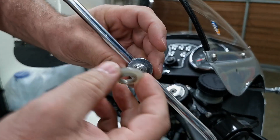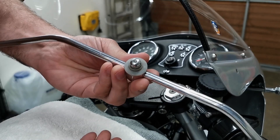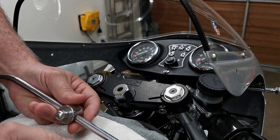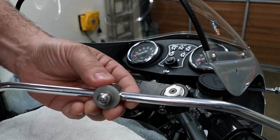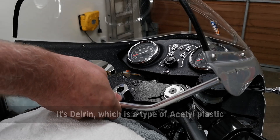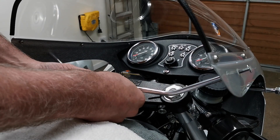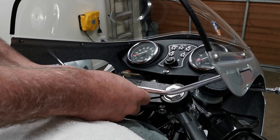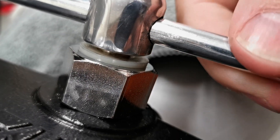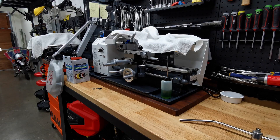One side has to spin - either the inside bit spins or the outside bit spins. I mean this piece either squishes down tightly onto that and stays there, or it squishes tightly into that and stays there, and then the other side is loose. One or the other. But that's what we're going to do - make something out of a piece of acetal to replace this. It'll be taller; in fact, as thick as this entire piece would be about right. It would sit much more securely. So let's get started.